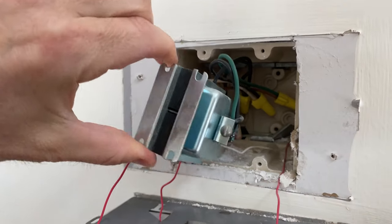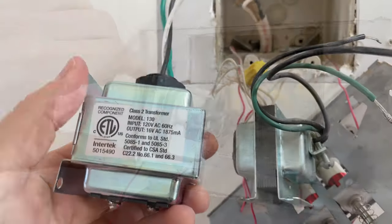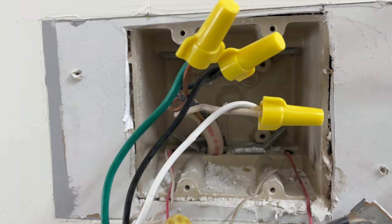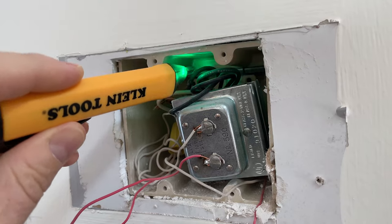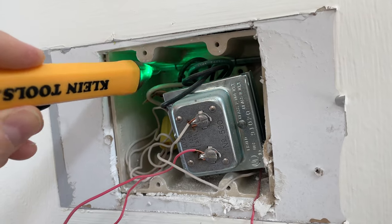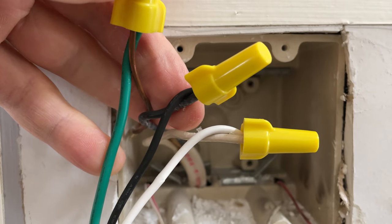The other part of that is it makes the whole install a little more difficult. I had to get up into the chime box, remove the old transformer, and install the new one — and that could be a bit scary for some people because you are dealing with high voltage. I made sure all the power was off, turned it off at the breaker box, and used various methods to confirm zero power at the transformer. Once I was certain there was no power it was a pretty straightforward process — I simply copied the wiring from the old transformer into the new one.